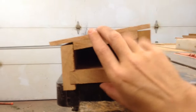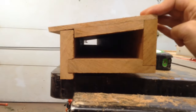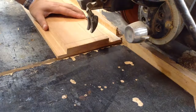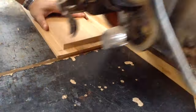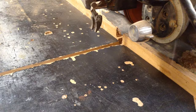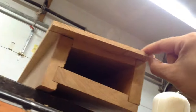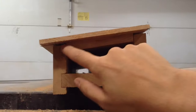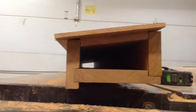Same process, four pieces — this one was slightly different because of the angle, but essentially the exact same concept. That's what it looks like. I put on the overhang on the edge, and then you'll see how I cut all of my grooves to turn this into a torsion box. That's the first overhang. Now I have this inner box and I'm going to go through and cut those as well so I could stick a piece on the edge.